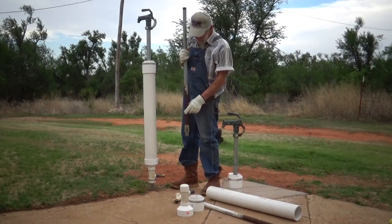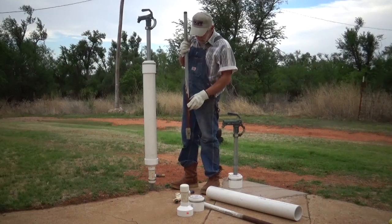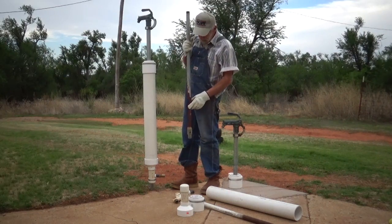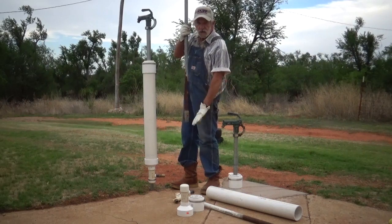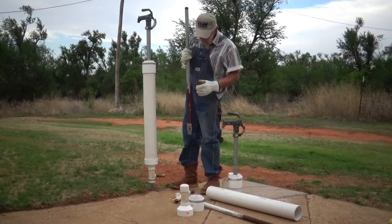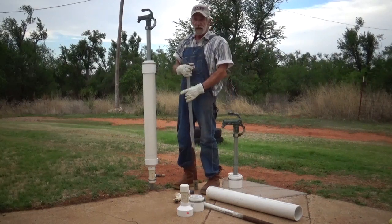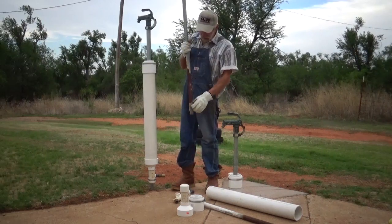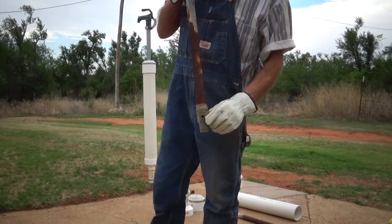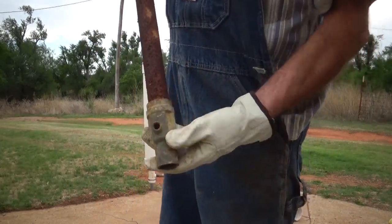When there's no drain field, they'll always be rusted. Depending on how corrosive your water is — and most of these hydrants are all galvanized — I've seen hydrants actually get rust holes in them in as little as two years. There's been nowhere for the water to drain; it's just saturated up around the pipe. On a direct-bury hydrant, the weep hole — or drain hole — is just a small hole there, and I don't know if you can see that.